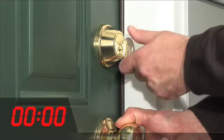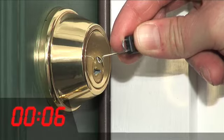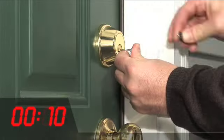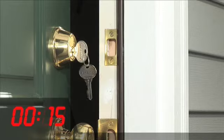Enter the user key that came with the lock and turn it to the recoding position. Enter the provided recoding tool into the notch at the top of the cylinder with the bend pointing down, and pull out the old key. Insert a new key and remove the recoding tool. The lock is now coded to work with the new key. The old key will no longer operate the lock.